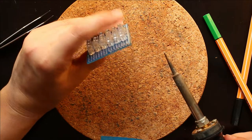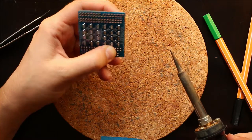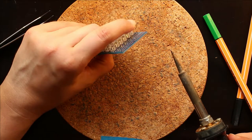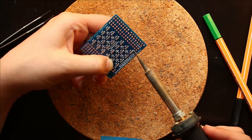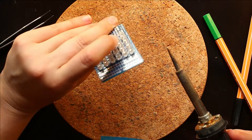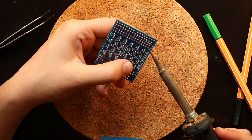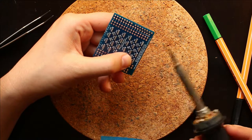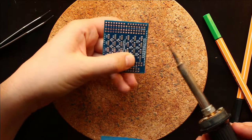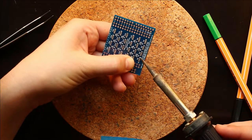So to straighten them, I hold the PCB with one hand, leaving this finger free, and I use this finger to gently slide the LED like this, while the solder is liquid. And by doing that, you can gently slide the LEDs into alignment. But you have to remember to let the solder re-solidify before you remove your finger. And I go through and I do that for each LED so that my RGB matrix looks really good.